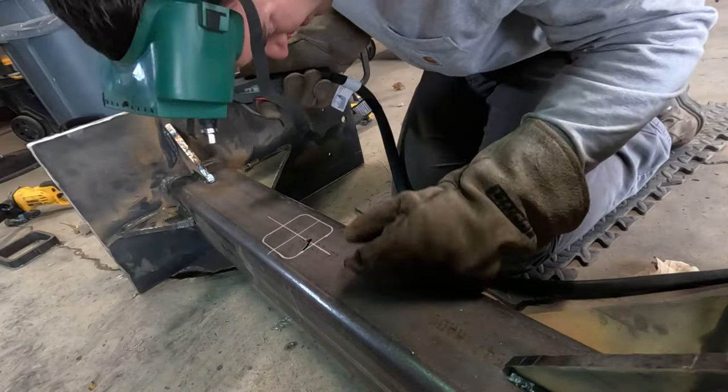Again, we got the spine, all the gussets made all around there. And the big gusset here, I was worried about this bending, because I thought the fear of bending was right here. And then to reinforce the hitch, I thought this was the weak point, so I did a spine that followed the curve of the tubing. Same on the bottom. And then I did gussets on the sides as well. So I tried to make it as heavy duty as possible.